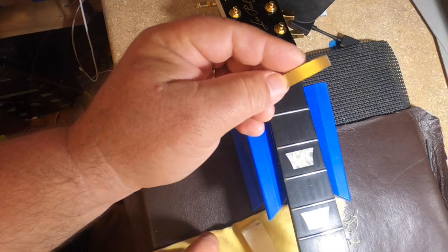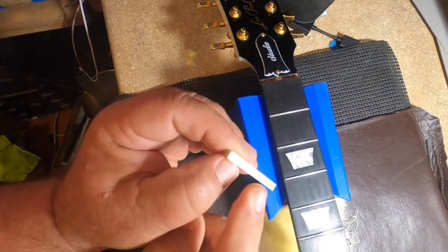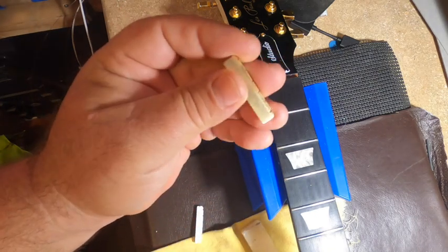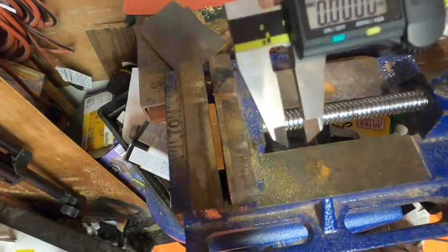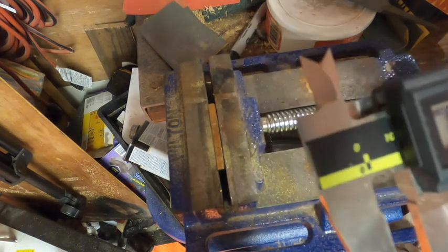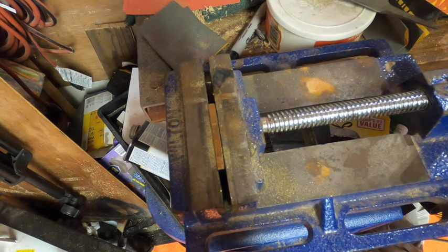The plan is to make the brass nut the same height as the original — I'll put it in a vise, make a mark, and file it flat. I won't leave a sanded finish; it's going to be highly polished when done. We've taken our depth dimension with calipers, zeroed to the original nut. The brass one is about 36 thousandths too big, so that's what we'll take off, then dress and polish it.